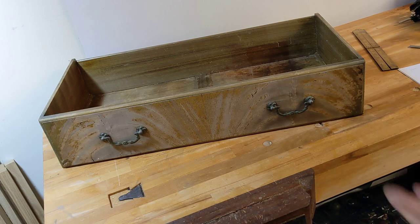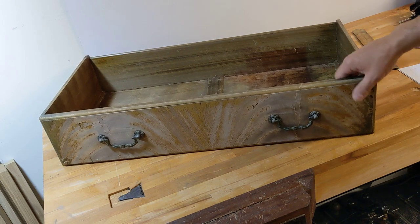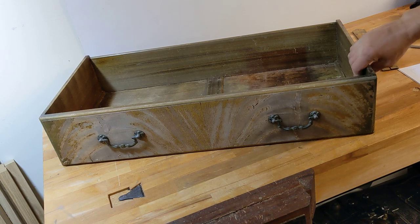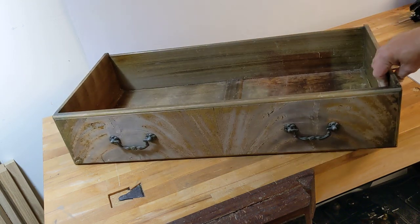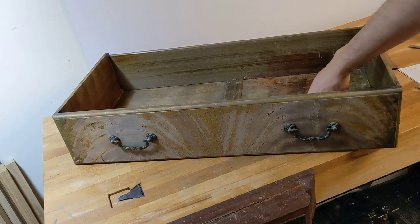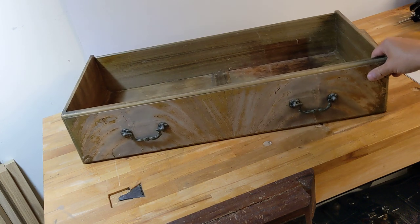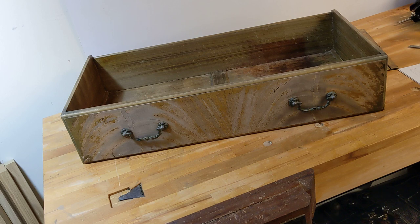And just to reassure you, you might think, oh God, that sounds a bit rubbish. Glue and pin on this, isn't it better to work it in a solid? Well, you think about how a drawer works. Now, the pressure is always down and it's always supported underneath. It's always rubbing there. I've seen drawers fail because we've had too much load put in here and it's rubbing on something, or people have dipped them to remove the finish and the joints have fallen apart, but I've never seen slips just fall off. You might have, I haven't.